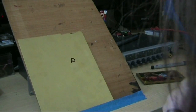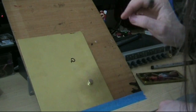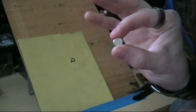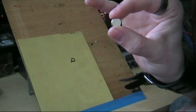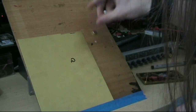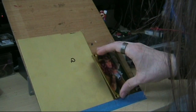Remember this is the speed from the wood. Now watch what happens when I put it on the brass plate. Notice how much slower it falls on the brass sheet than it does on the wood. This isn't because the brass is attracting the magnet magnetically — this is because eddy currents are generating their own magnetic field which opposes the field of the magnet. You get a magnetic friction effect, magnetic braking it's sometimes called. We get the same results if we use aluminium — if I drop the magnet down the aluminium plate, it also travels slow.